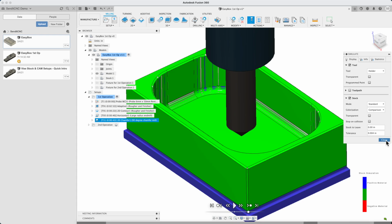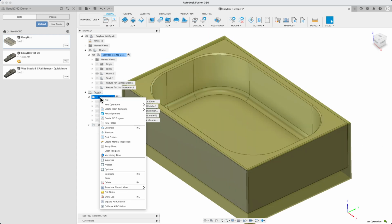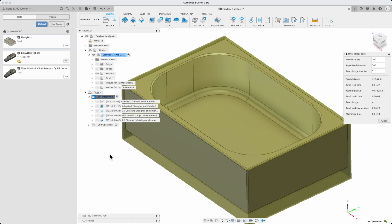Okay, we need to flip the part over and finish the bottom, and we'll do that in the next video. But right now we're going to submit what we have here to SendItCNC, and we will receive an aluminum part that looks like what we're seeing here in the simulation, and the job could be submitted, cut, and shipped all in the same day. Let's take a look at Fusion 360's estimate for the machining time.